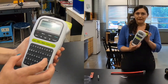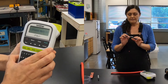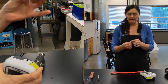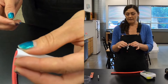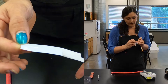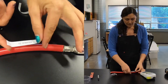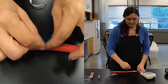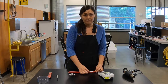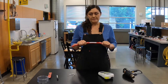Another option: you can get one of these cheap label makers that have the sticky on the back. You print out your label, pinch it in half to get it started, and put it on the cable. This is a really good way to make your work look professional, but if all we do is leave this label here — wet environment, adhesives — they're soluble, it's going to come off or get scraped off.